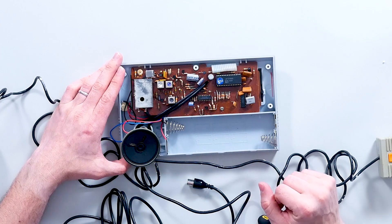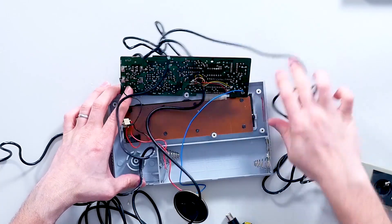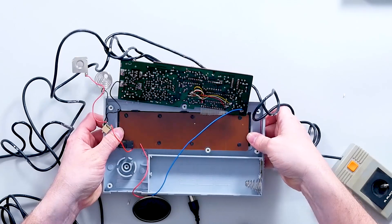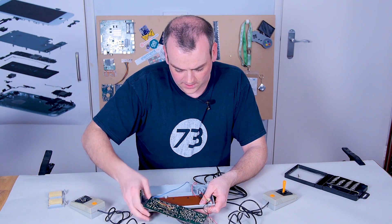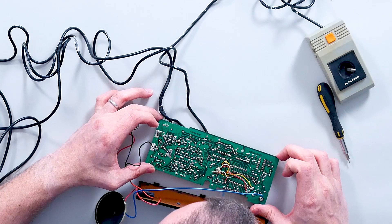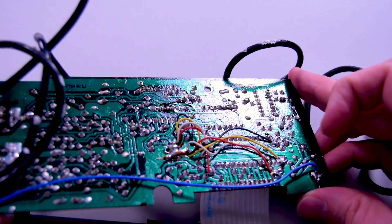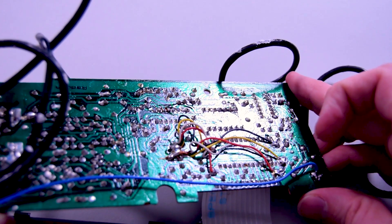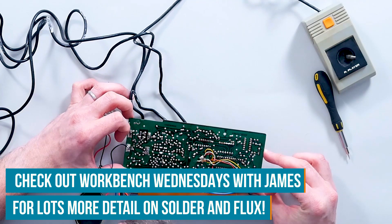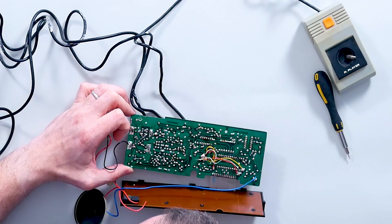You can see it's actually socketed, so we can actually remove it in a DIP format. That seems to have been just a single screw holding that on. We've got a second board which is either ultrasonically or thermally welded to the keyboard. This is actually made in-house. There's definitely a kind of patina of flux over the entire board - it looks like it was wave-soldered, but nobody ever cleaned it. It's obviously not corrosive, otherwise we'd just be left with a pile of dust. And there's what appears to be a bodge wire over there with really questionable soldering.